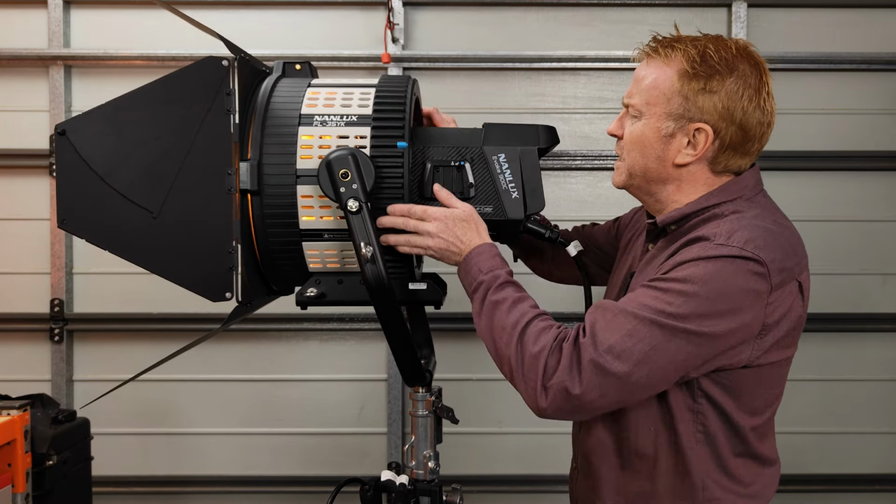But that is not the case with this light because it is one of the most highly calibrated light engines that I've come across. So here I've got some random color hues dialed in and I'm cross-fading to them from 5600 Kelvin. The crossover duration is 2.5 seconds. As you can see, it's not cross-fading to any other color in between and there's no radical changes in exposure.